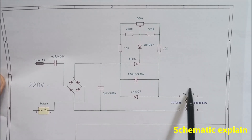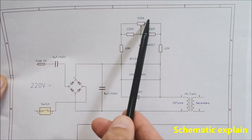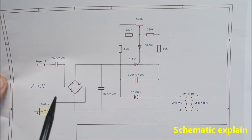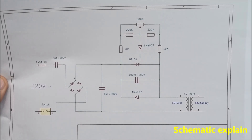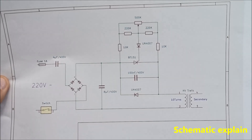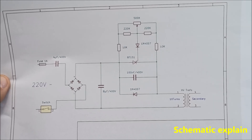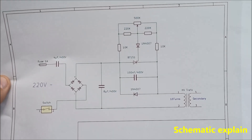The flyback high voltage transformer is driven through 10 turns on the primary. With the potentiometer we bring a certain gate current to turn it on, and at that moment the SCR conducts and discharges the eight microfarad capacitor through the primary windings of the flyback transformer. Then there is a pause until the capacitor is recharged and this process repeats. Changing the potentiometer setting changes the SCR's firing threshold relative to the capacitor voltage — when the SCR fires at a lower capacitor voltage the firing frequency increases but the output voltage decreases.